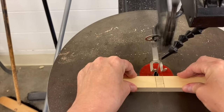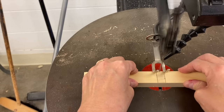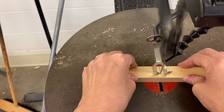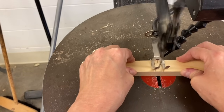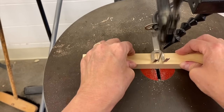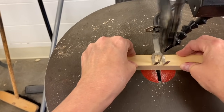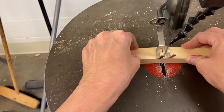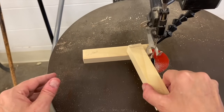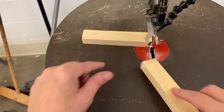I'm pressing down on the wood — I can feel it in my triceps. I'm slowly bringing it in. When I start getting to the end, I want to slow down, otherwise I'll get a jerky movement that sends it forward too fast. Once I'm close and almost through, take it really slow but still press down on the table — that's preventing it from bouncing. If you have a piece of wood stuck near the blade, wait for the blade to stop and then use a scrap piece of wood to knock it out of the way so your finger doesn't get close to the blade.